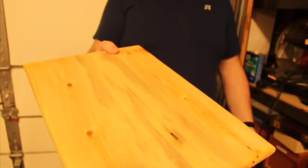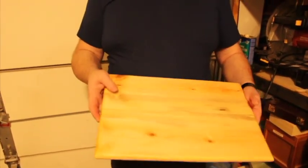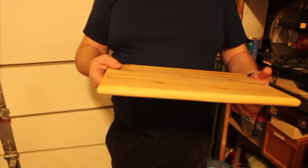In any case, folks, this is our show for today. This is actually fun. It is so smooth, so nice to hold. Try it. Oh, yeah. It looks fantastic, I think, and can be the basis of a lot of projects. You can make a small table, a big table, bookcases. This connection system can be used to make wider boards or even longer, end-to-end boards, as long as you edge them. When we first put them together, there was a little gap, but we passed them through our jointer, and the result is just spectacular.